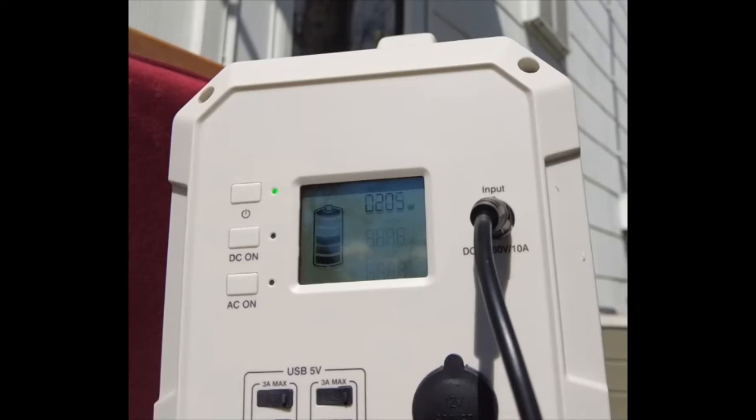It's simple division: take how many watts the item uses, let's say a microwave or Instapot — you just look up the wattage and do the math. Let's say I have 1,200 watt-hours and an appliance takes 1,000 watts — I have a little over an hour of use if I'm not charging it. If you were at maximum solar input — which I think is 500 watts — you can use stuff for a long time.